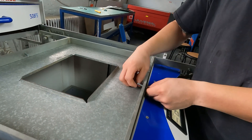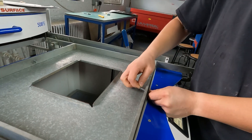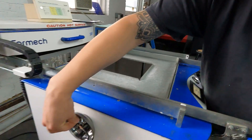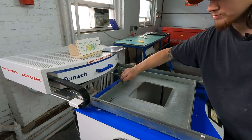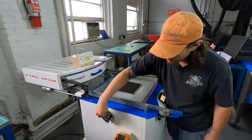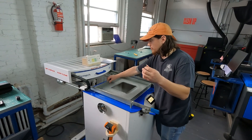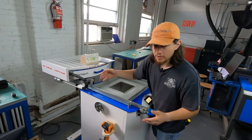What I need to do is remove these pins so that I can get rid of this reducing window. There's a little cotter pin on the inside here, and I'm just going to push this pin up and grab the loop and pull that out. Once I've done that, I'm going to put it in the little magnet tray so I don't lose it. I'll do the same thing for the back pin — pull the pin out, stick it in the magnet tray, and then push each of these two pins out of the frame and set those in the magnet tray so they don't get lost either.